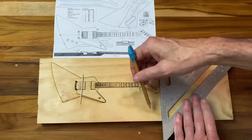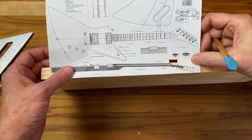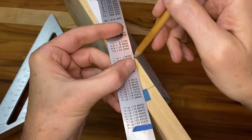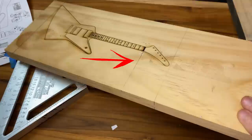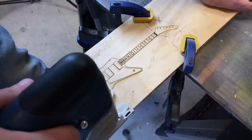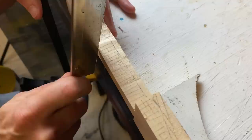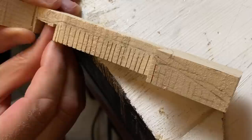The wood is going to be too thick for a little guitar, but we need some extra wood for this headstock angle — the headstock where the tuners are is at an angle, so we need that extra material. The body's too thick, but I'm gonna route out certain sections at the specific depth that I need. Why didn't you just use your laser cutter? The laser cutter I have leaves burn marks, so we're doing this old school.